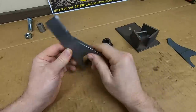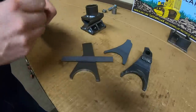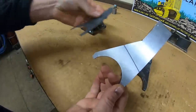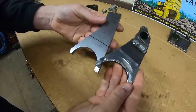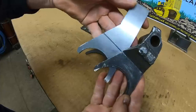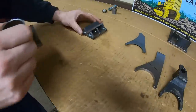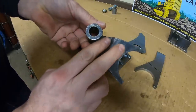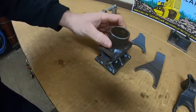Let's decide where the bends need to be. Using the template I got the first bend line transcribed onto the blank, so we should line in well — and yes, it's a pretty good match to the witness mark from the original. For this I built just a small V-block set that matched all the witness marks on the original blank. Looks like we had a one-inch spacing there and then a sharp point came down on the other side. That's how we work with this.